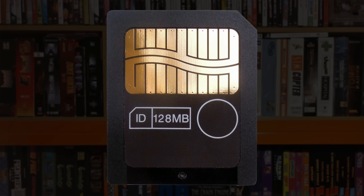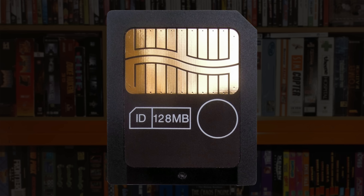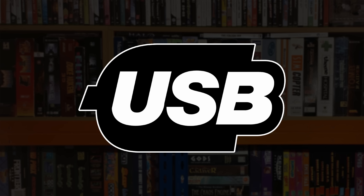The cards themselves were built around a single NAND flash chip with no onboard controller, to keep costs down, and were capable of speeds of up to 2Mbps — more than enough to saturate the first generation of low-speed USB ports that maxed out at 1.5Mbps, which had started to appear in early 1996. But USB was exotic new technology and still a rare luxury to most people in '96, and wouldn't start to see mass adoption until version 1.1 came around in late '98.